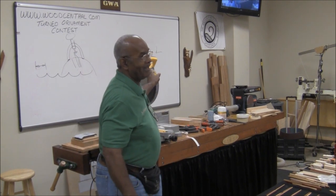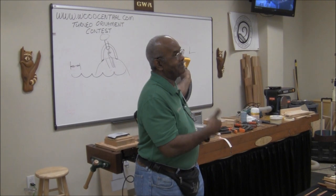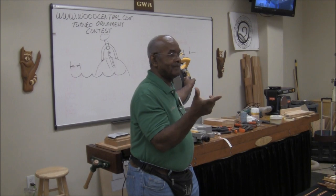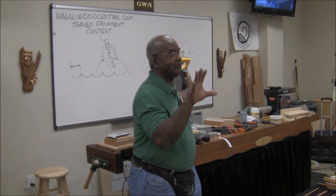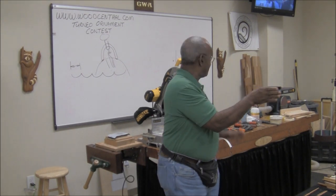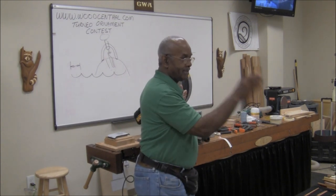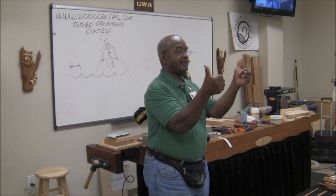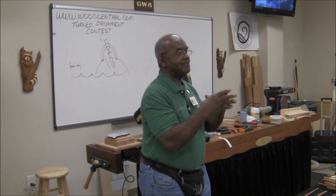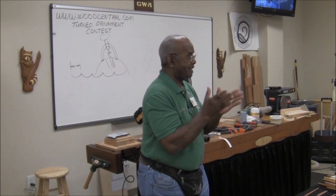Every cut, I wasn't going to do this demonstration because the older members have seen me do it so many times. But even when you see me do it, you still learn a little something that you didn't remember before. But for new members, showing you how, I never cut, number one, on any saw if I'm not looking at the blade. All right? On this saw here, when I make boxes, everything is turned this way because I'm right-handed. And I'm looking at the blade, which means I know where these things are. And the other thing is, I never put my hands where they're within 5 inches of any saw blade, period. And I don't have kickback in my shop.